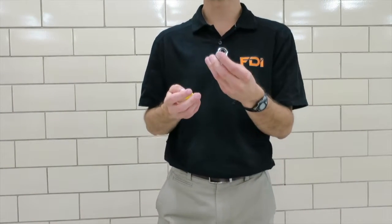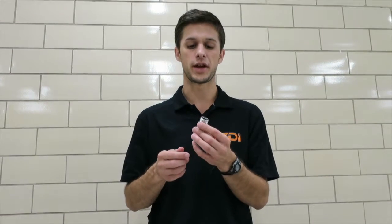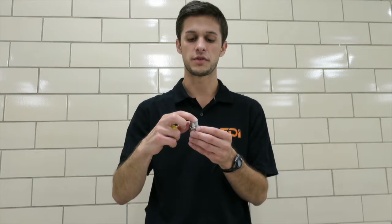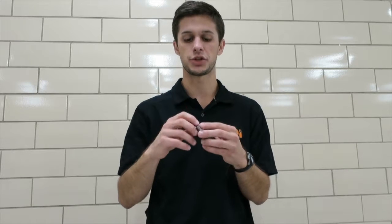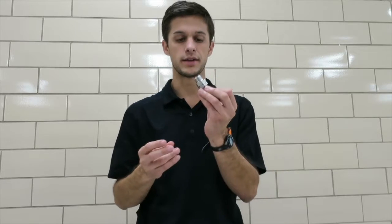Then we have VCO fittings. These fittings are for the three hoses that connect the sterilizer main unit to the water recovery system. These will be installed, and a hose will come here and tighten down. The big thing on the VCO fittings is the O-ring. You always have to make sure the O-ring is in place and that it's not damaged. When the hose tightens down, it seals up against that O-ring, and it's good for vacuum pressure. Very reliable seal, but you have to make sure the O-ring is there. So that is the VCO fitting.